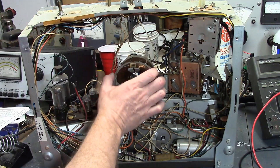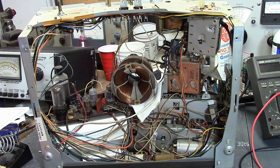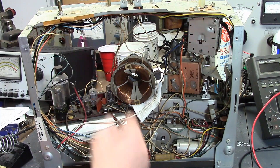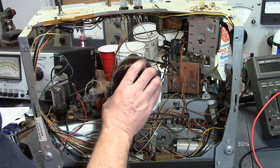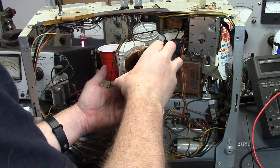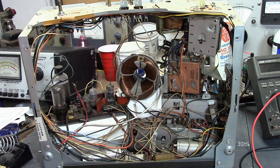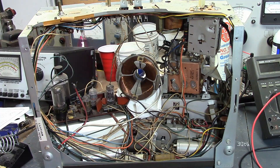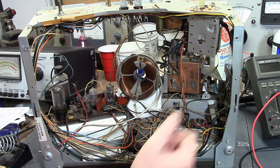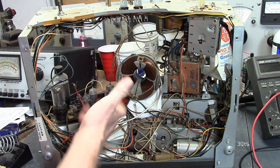I'm thinking I really should disconnect this — when I move it around it's going to tip over and tug on the wires. I'll document where they're attached; there aren't that many — I think just four, maybe five. Usually two or three on the horizontal and two on the vertical. So, where to start? We could redo the electrolytics, start on the paper caps on terminal strips here and there, or take out the circuit boards.